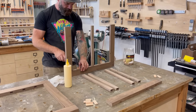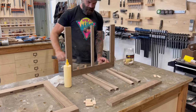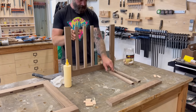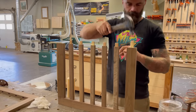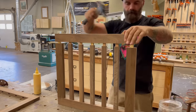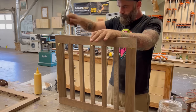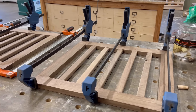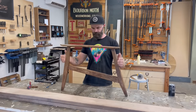After applying glue to those three dominoes, I inserted the other dominoes dry and then slid on those slats — I think you call them slats, they're skinny straight pieces of wood; I'm going with slats. With all my slats and side stiles inserted into my bottom piece, I did the same domino pattern on top, gluing three of those seven dominoes and slapping on the top piece. You can see I get squeeze-out on every single one I added glue to — imagine the cleanup mess if I'd glued every single slat. In no time, my seat assembly was all in clamps and I could start focusing on my leg assembly.